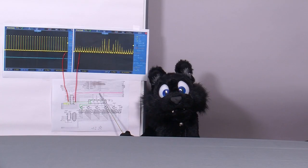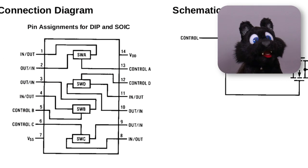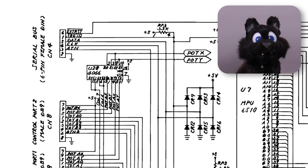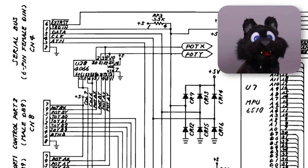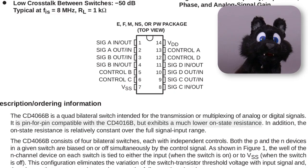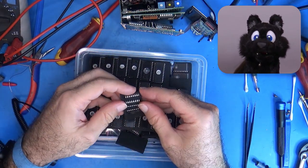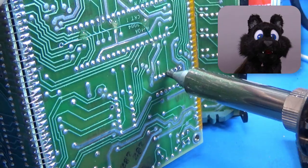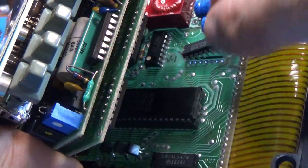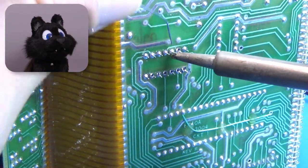Another spare part to wait for — but then I peeked into the datasheet of that IC and it looked incredibly familiar. I checked the schematic of the C64. Well, almost! There's a 4066 in here that has similar functionality. The datasheet said this chip is pin-compatible with the 4016, just with better values for ON resistance. I have some of those chips in stock, actually, from my SX64 fix. So I have a chip here that is even the same vintage as the meter. Out with the old, in with the almost-as-old.